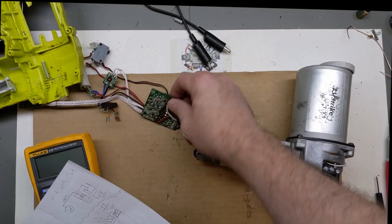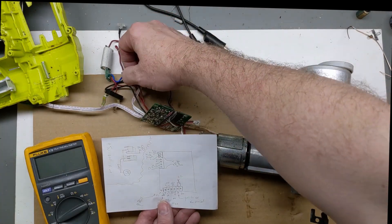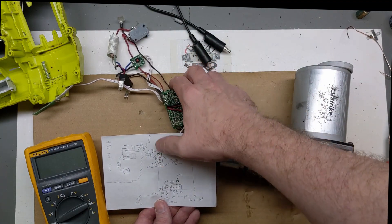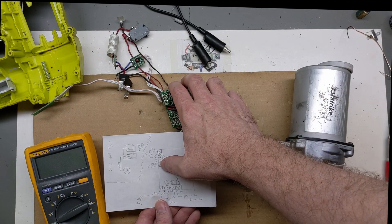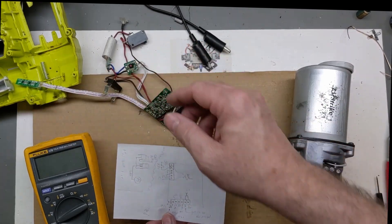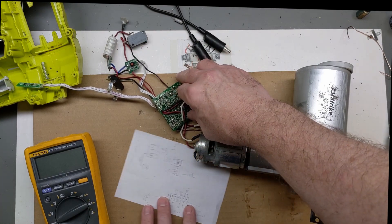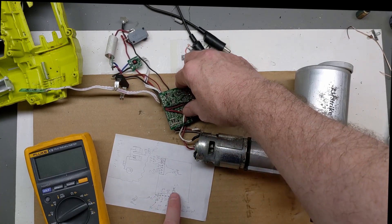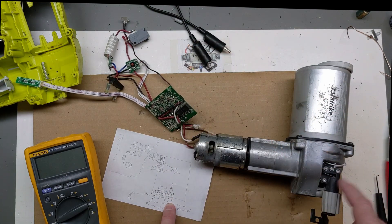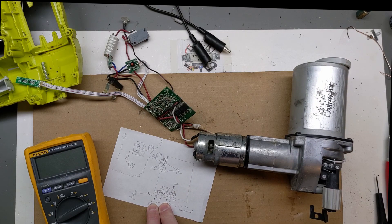Our 20 volts. The push button from here comes in on this side - I just checked it: 0 volts and 5 volts and 5.5. Those last two are coming from the reed switch and they'll go to zero with the magnet. Going around here - our LEDs, our limit switch on the end, which one I took loose. I'm getting my zero volts showing here. I've drawn out the MOSFETs where the black comes in - they actually check fine. It's just not getting a gate because something in the processor is not letting it.